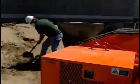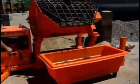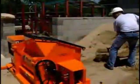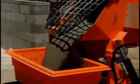Load the mixer with sand, mortar, or pea gravel at a low height and still have the ability to dump into a mud pan or a hog trough easily. The Mud Hog also provides a high dump feature — simply load the mixer at a normal height and the Mud Hog raises to dump directly into your Grout Hog or other high mud pan.